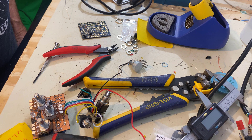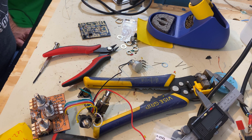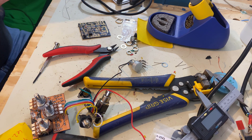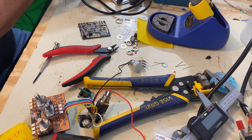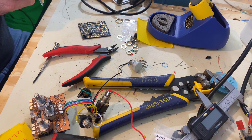I got those in there. If you have a component that's a little bit off, you could still use it. I'm not a harsh stickler for demanding that every component be perfect. Sometimes that's part of the charm between pedals. I would say that this 1.43K is close enough to a 1.5K that nobody's going to complain. There are tolerances anyway - these are 1%, but it's close.